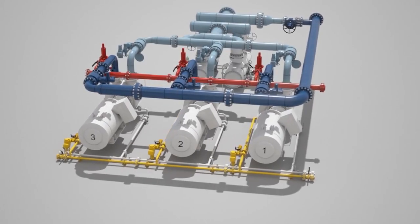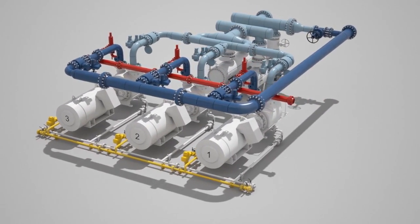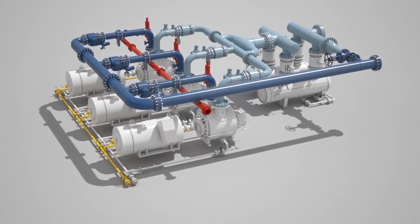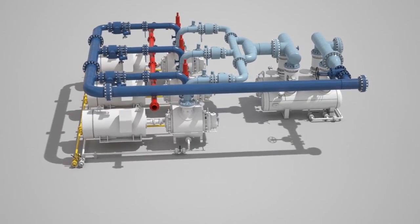In the following animation, we are depicting a three-pump multi-phase system with each pump rated for 50% total capacity. In this configuration, normally two pumps are operated in parallel, with a third installed as a standby for emergencies or standard preventative maintenance protocol.